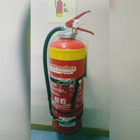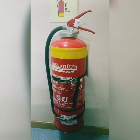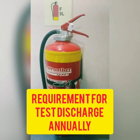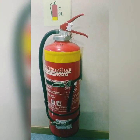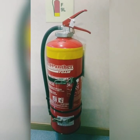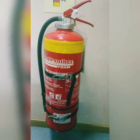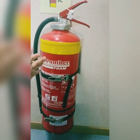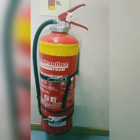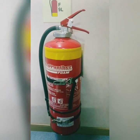The requirement as per flag state may differ — for example, Singapore flag requires this extinguisher to be test-discharged at yearly intervals. But if the company requirement says you must discharge every 2 months, then you must discharge 2-monthly as per the company and carry out training. You must also ensure that the spare charges for such extinguishers do not decrease below the regulation requirement. Make sure you always have sufficient spares on board.